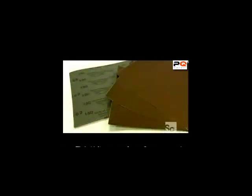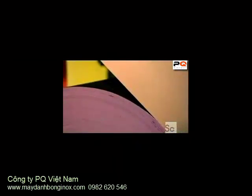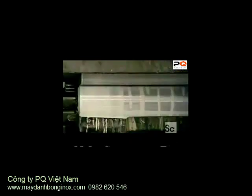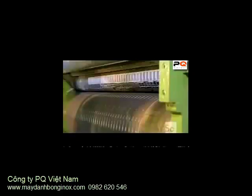It's ironic that something so abrasive can make things look so smooth and polished. Sandpaper often isn't made from paper at all, but fabric like polycotton. The cloth is unwound into a machine with a printing press. Rollers lined with rubber printers stamp product information onto the cloth.